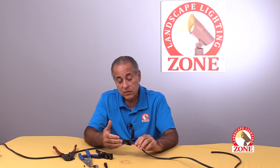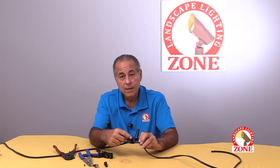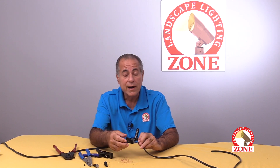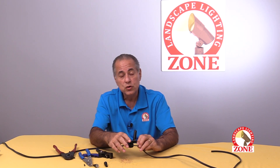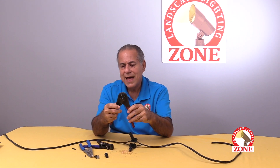Most splices, you're going to have multiple wires coming in — you might have up to four for this size tube. If you're trying to splice together more than four wires, go to a larger tube and a larger crimp. You'll use the same crimping tool, but it has a slide that accommodates larger and smaller size crimps.